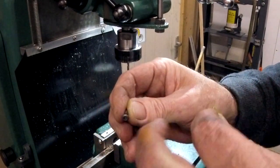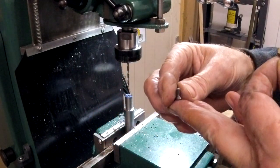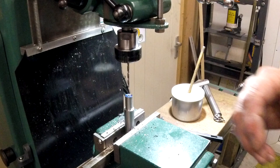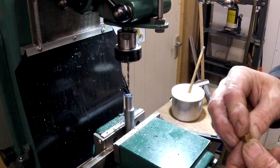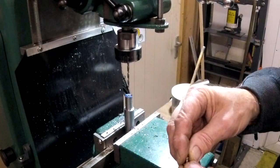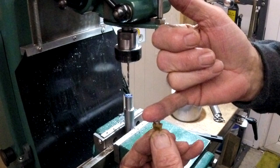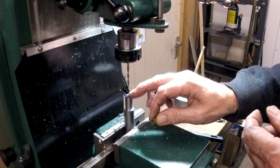They're like little torx screws. I thought, oh yeah, that's M4 — I'll drill and tap that for M4. But it ain't — they're M3.5. So that's no good because I haven't got an M3.5 tap. It's a little Allen screw and all I've done is put it in the lathe and just taken a little bit off the edge. It's a countersunk socket head and I've just taken a bit off and tried to chamfer it slightly so that it fits in there to get a central grip.